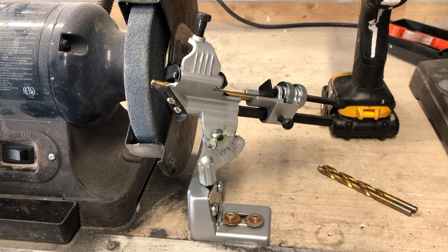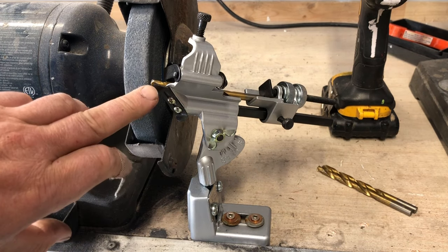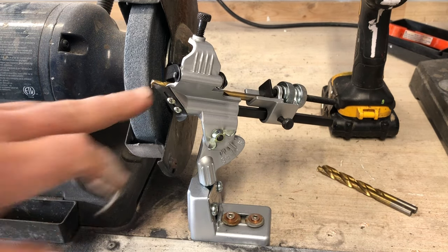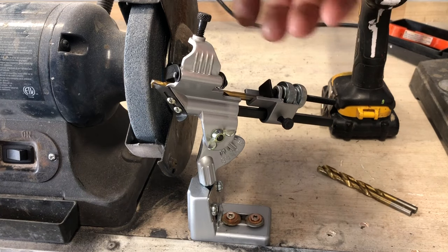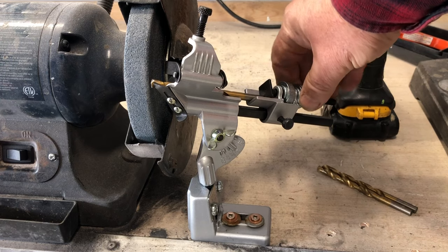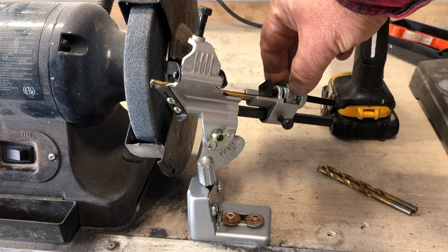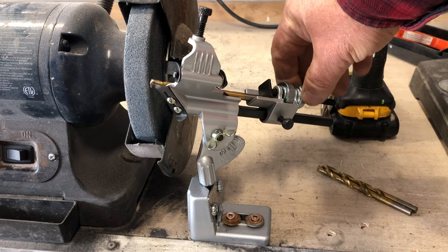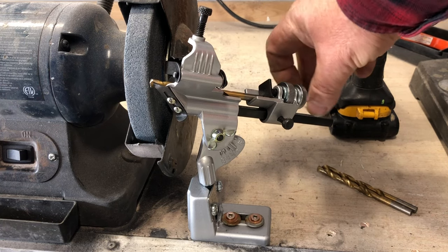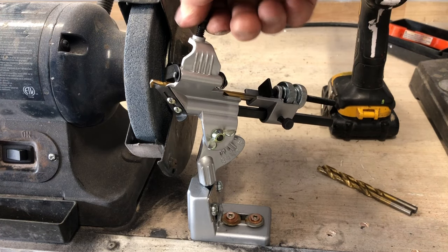That's pretty good. If your drill bit isn't too mangled, that might be enough — just one little pass. But if you get a lot of roughness, if your drill bit is really far gone, what you might want to do is move it up a little bit. Back off the lock-down, back off this locking nut here, and move it up just a little bit — not a lot. Then lock it back on, tighten it down, and do another pass.